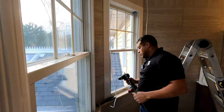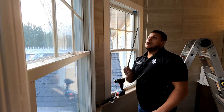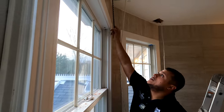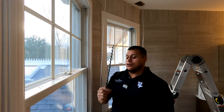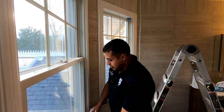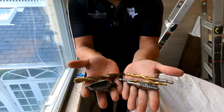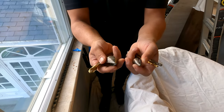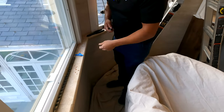Let's go over what we need to do this. We obviously need a drill, and then we're going to need some bits. We need one long bit to traverse the entire way — that's why I'm using this long bit, because it will make it through everything. However, this is a wood auger; we don't want to use this to drill through metal or stone. We also have several metal bits, as well as some unibits or step drill bits to achieve this.